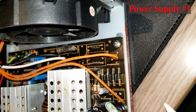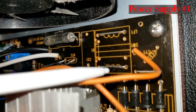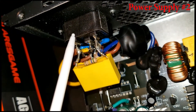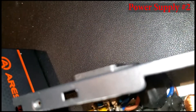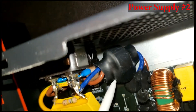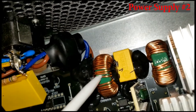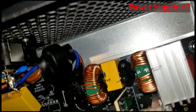Now we are moving to the second power supply. Again, from the external input connector, you can see right away a capacitor in parallel with the input. It goes then to the on-off switch. Right after that, it goes into what I assume is a choke inductor, likely around a ferrite core, and then two more inductors and a capacitor — basically a good amount of filtering. Certainly this power supply has much better filtering than the previous one, and the good results were showing in the testing.